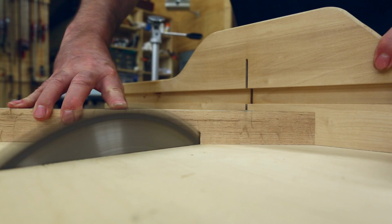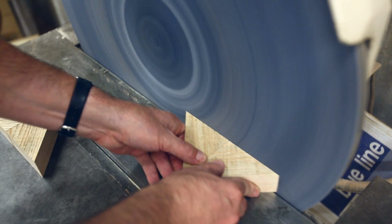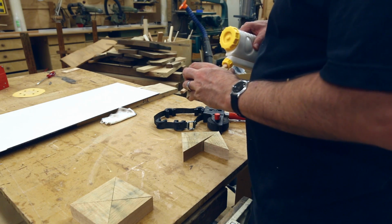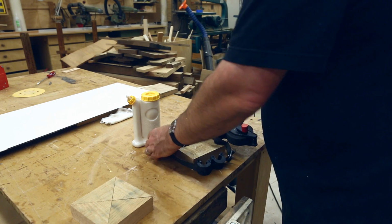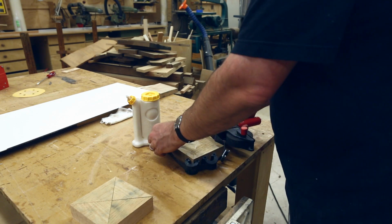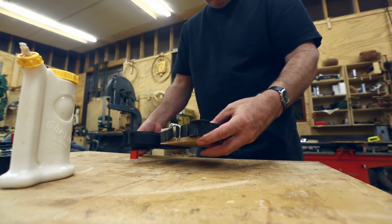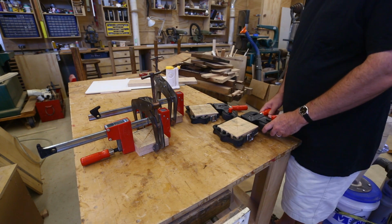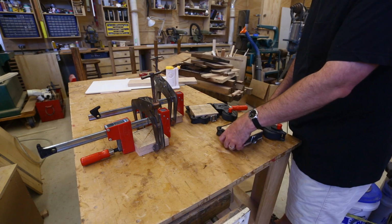So I made little four-sided segmented squares to then turn into the coat hooks. So I glued those together. I just did them all at once. Now for two of them I used the band clamps, which were a little bit on the big side. So I got three of the corners attached, and then one side is just the band, but it was fine. Then for two of them, I used sort of opposing clamps on the two sides, and that seemed to work as well.